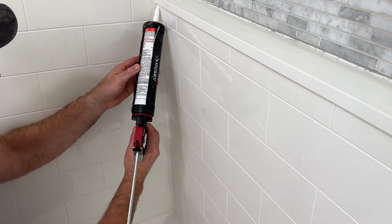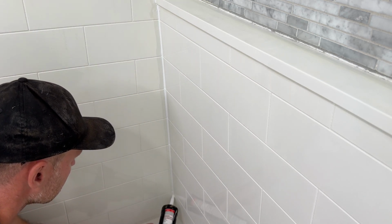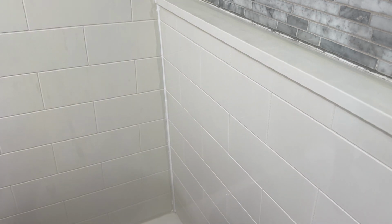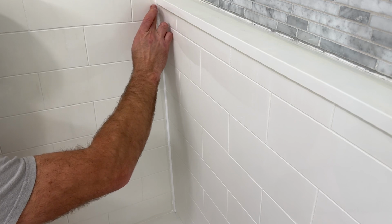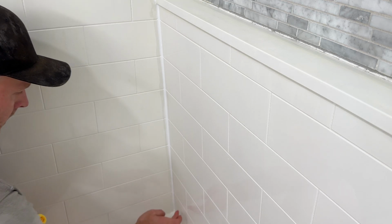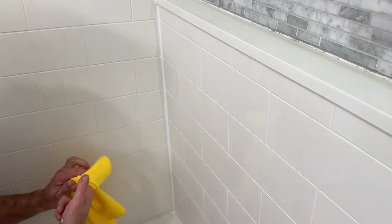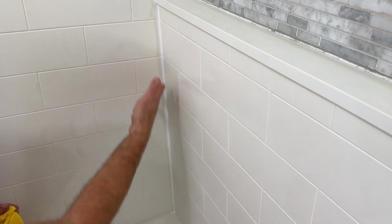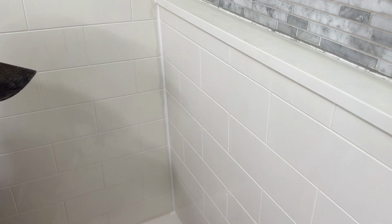And then this corner. If you have a bump anywhere, what you do is with a wet finger, start from one side and just glide outwards, and that will fix it. You don't really have to do the whole thing. Same here. There you go, nice and smooth. Connection on the bottom, I'll show you guys as well. But the bottom here will tape up.